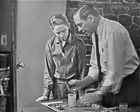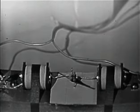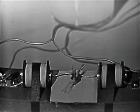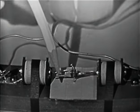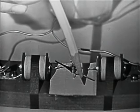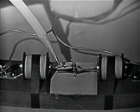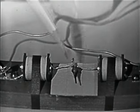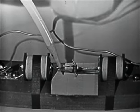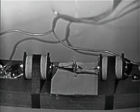Now, try it again. Now, see how it pushed it away that time? Sometimes you'll find that perhaps the compass needle is magnetized in the same direction as the current flows. If that's the case, turn the needle around like this and try to get it to stop right like that. Then when you plunge it in now, see, it's the same way now. This is the opposite pole of that. So you turn it around in that case so that it's stuck on the wire. There. Now when you plunge it in, it'll push away. So you're all set. Now you have a galvanometer.